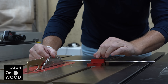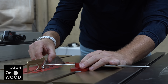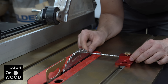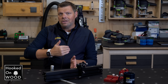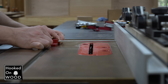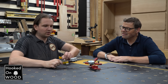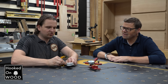We prefer the dial gauges, but we are convinced that the outcome would remain the same. With this saw gauge you can perfectly align your miter track and your fence. But there are some disadvantages of this design: when you want to slide it to the other side of your saw blade, it takes more care because it cannot go over the curve, and when the deviation is towards the saw gauge, it gets stuck. The dial gauges give a better reference of the degree of deviations. After some testing, we concluded that we like the black and yellow dial gauge the most. We think the design is the most practical and convenient when aligning your saw blade or fence.